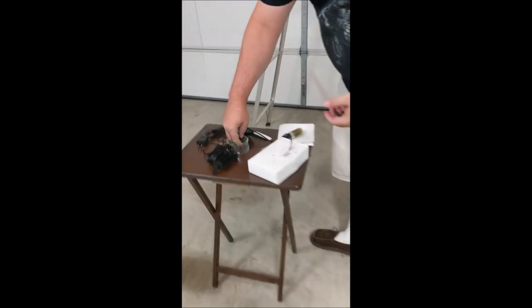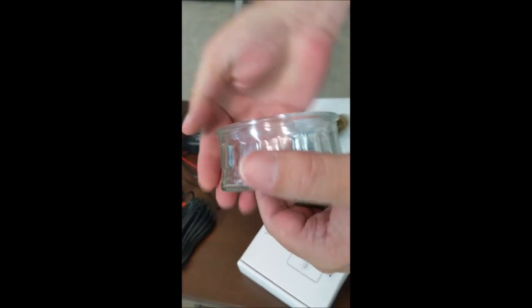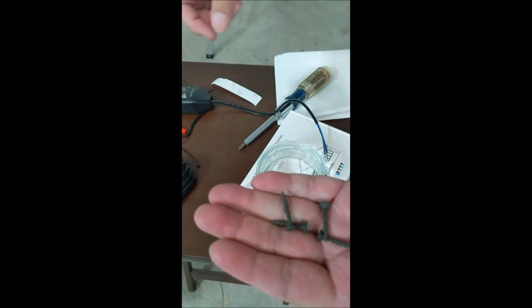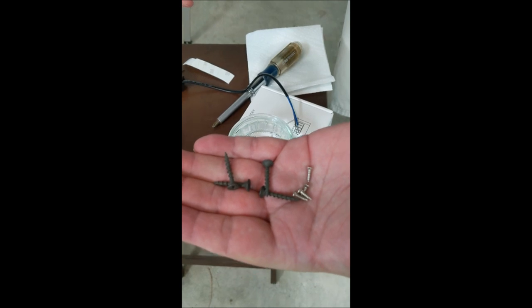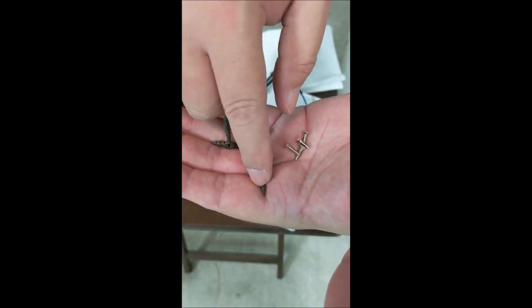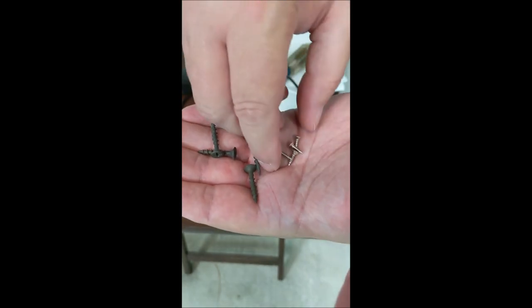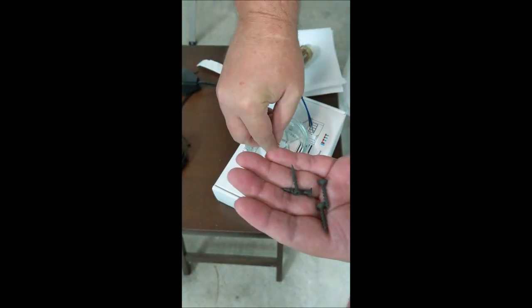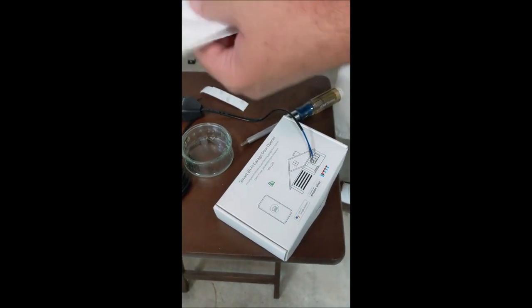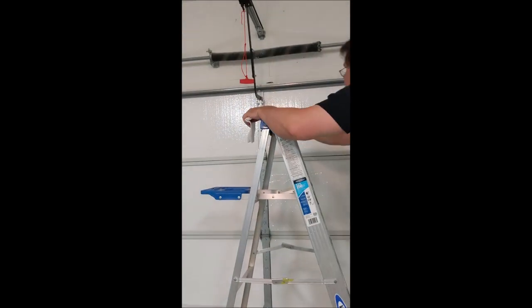Just so you can see the difference here — here's the screws that came with the unit, and here's the screws I'm going to use to install it. You'll see there's definitely a difference in the size, and the coarseness of the thread in wood is actually bigger to be more coarse. The finer coarseness is better for metals and things like that. So we're going to put these in here. I've got a paper towel with a lot of Windex on it — we're going to clean up the areas where we're going to mount these things, get those nice and clean so they'll stick well.